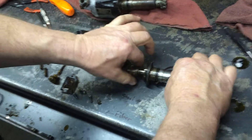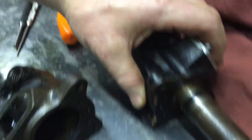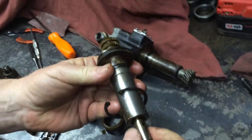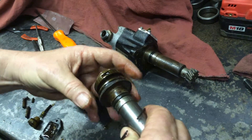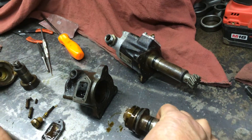This is the piece that comes out with the big snap ring on the end here. You take that big snap ring out — here it is. This is an eccentric, and as everything spins, that spins around and it rolls this gear and gets everything going. That's really all that's going on there as far as pumping.